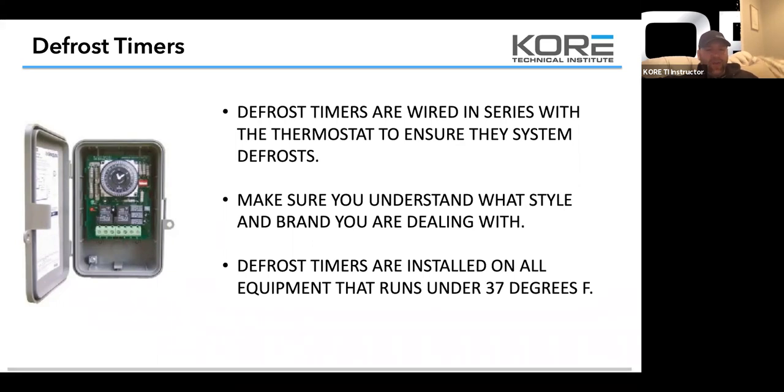That face gets jammed up. It's all made of plastic. It's cheesy. It binds up when it gets a little bit of dirt or dust in it. So you can take the two screws out and look at what the voltage is on the backside of the clock. I carry a 120 and a 240 clock. You can just snap a time clock right onto that board.